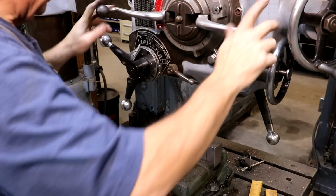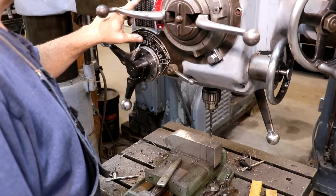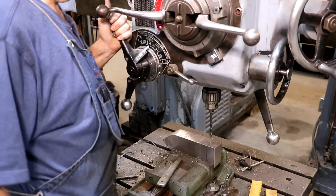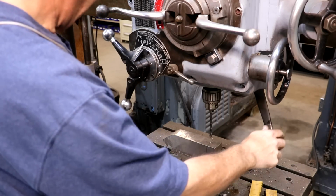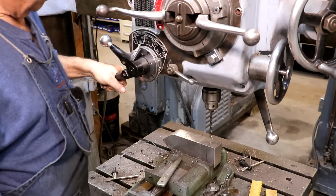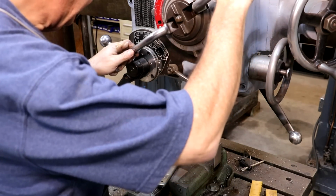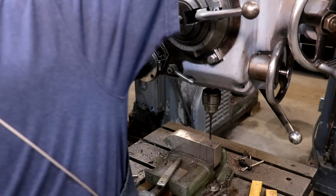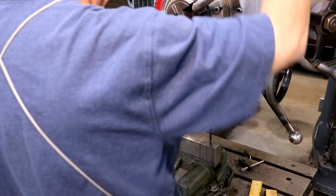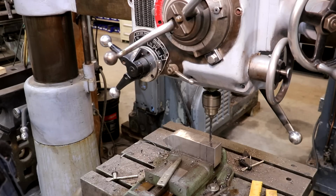Drill this over here at the radial drill. I got a drill bit in here. It's about a 3/8 inch drill, and for mild steel, I still get the alloy steel 611 RPM. So the closest I got to that's about 505, which is right there. There we go. I'm going to go down here and kind of start that. It looks like it needs to. That's better. I'm going to relock my table down there. All right, let's let her drill.